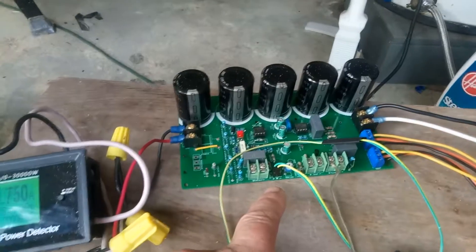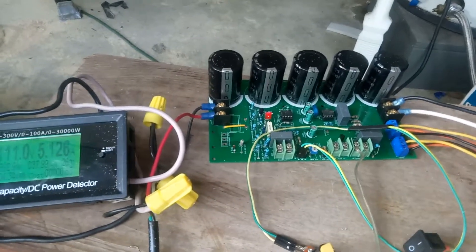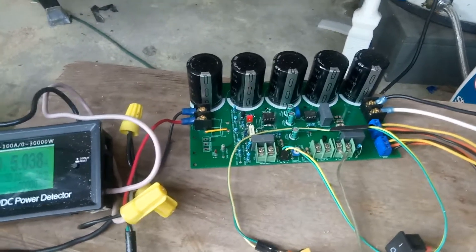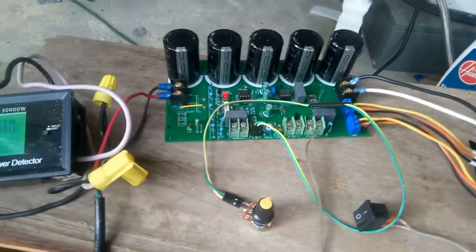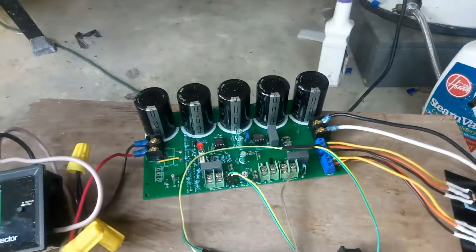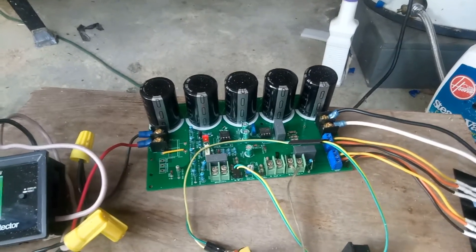The green goes to the far left of the three terminals and the yellow goes to the middle one. It's not really that important except if you do something later on. Over here we have a thermostat connection, and that just goes to the switch so you can turn it on and off. These are the heater wires that can go right to your heater through a normal thermostat, and this has arc interrupt so it won't damage anything.